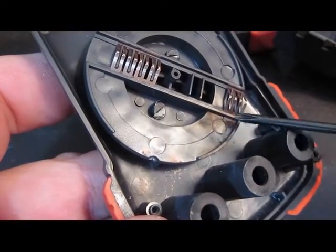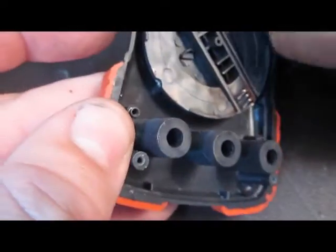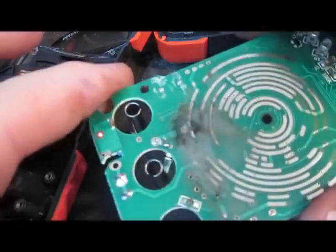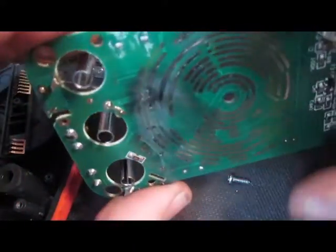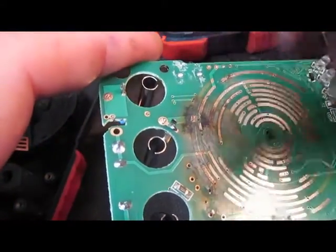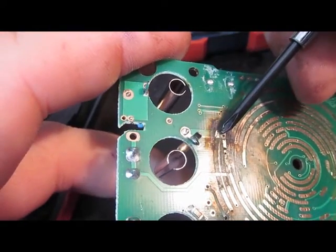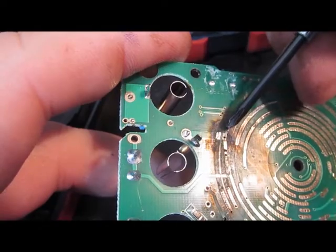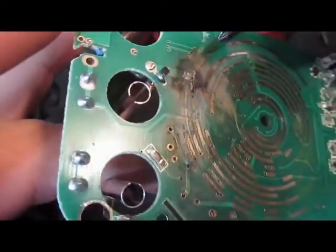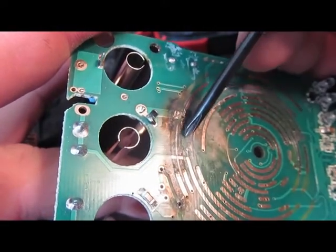Let's take this out of the case. Again we can see the discoloration up in this area, all the way through to here. That was in AC volts mode - that wasn't even in ohms mode. This trace going up to the selector switch - this whole area is just vaporized. As a matter of fact, this down here is vaporized too. It looks like this trace from here into the via - there used to be a pad in this area. That's totally gone now as well.